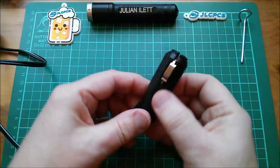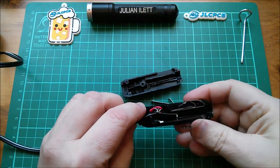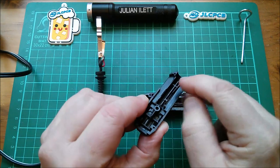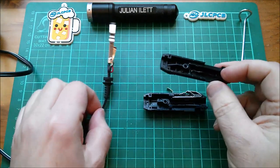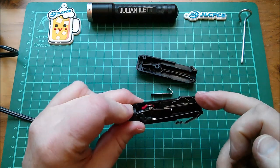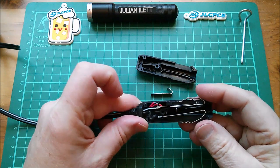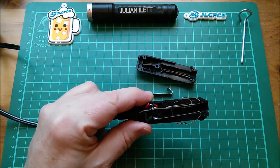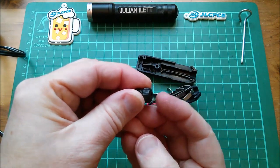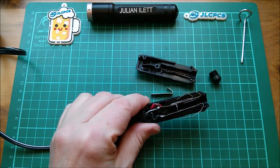Let's take a look inside. What's melted? It's hard to see because most of the stuff in here is metal, but what's actually melted are all the sort of channels, the plastic strips. Things just sort of moved and the positive got very close to the negative. It didn't actually short, I don't think, because nothing went bang or cut out, but it just stopped working because the little pip which protrudes out of the front sort of vanished inside — everything retreated back into the plug under the pressure of the spring.